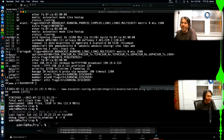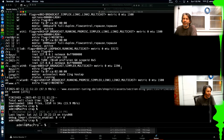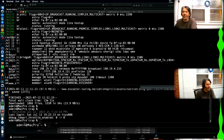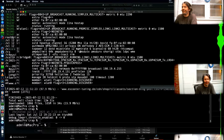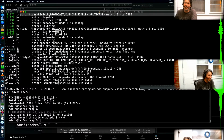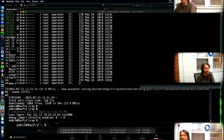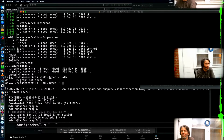So yeah, here we are SSH'd into the AirPort Express. Like I say, this is the dual band model. So it's Atheros-based, ATH79 chipset. Looks like they're using old MadWifi era drivers here because we start with the ath devices. It's a pretty limited grep. Nope.